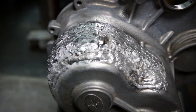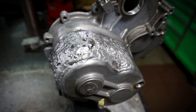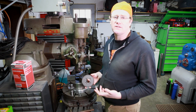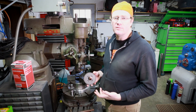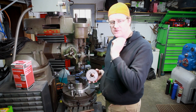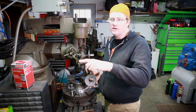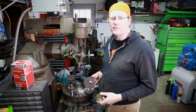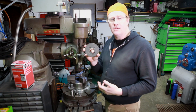As you can see here, I got this guy filled in. Not the super prettiest thing in the world, but I'm not going to complain — it does what they need it to do. I'm really, really impressed with how well that HTP ProPulse 220 welder does. I've never done any pulse MIG welding before, pulse on pulse. That pulse on pulse program just lays it in there — you can almost watch the droplets shoot off right into your puddle. You can run it up, down, side to side, any position. It doesn't matter. It's kind of like a squirt gun for metal. I'll do some more videos with it, but we're going to go ahead and machine out another gear here.